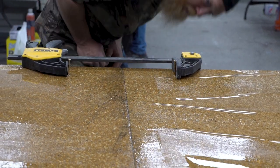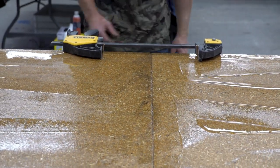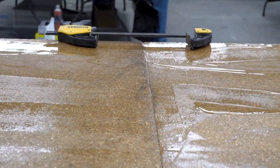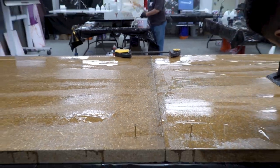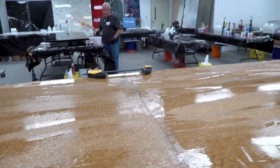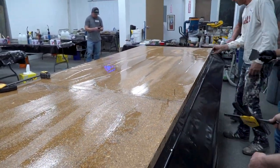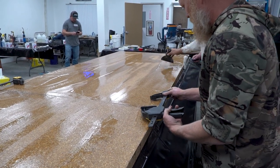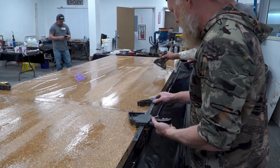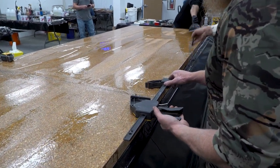So when you're doing a countertop in place, what mil plastic do you use? Do you use 5 mil or do you use something? 5 or 7 or whatever the heavy gauge, whatever this is. I'm not really picky when I'm doing it. When I'm doing it in place and I'm just masking, the floor will get the heavy gauge like this. The countertop will just get the 3M tape and drape the cabinets, but I usually double layer it. I'm usually pretty careful.